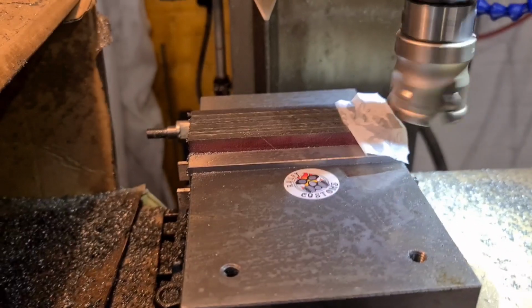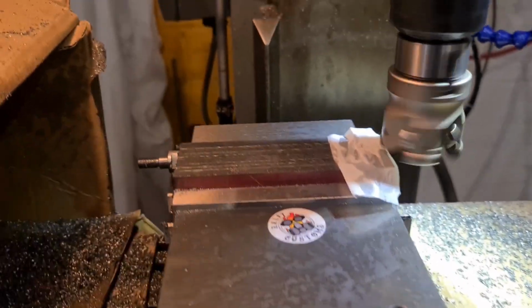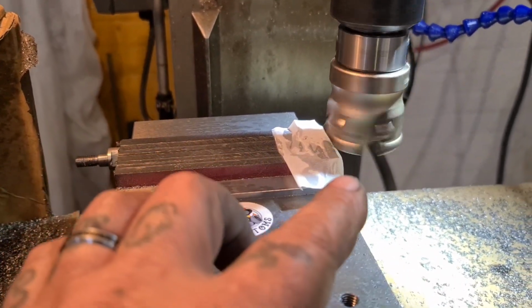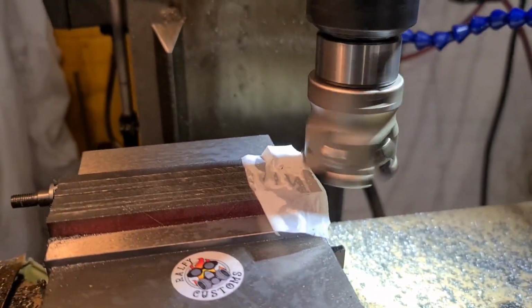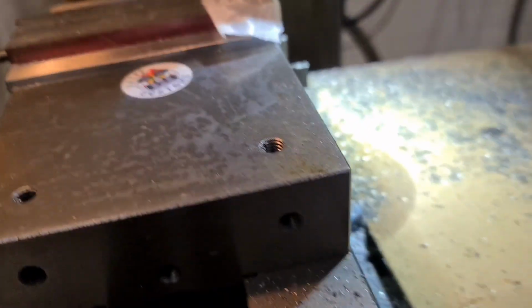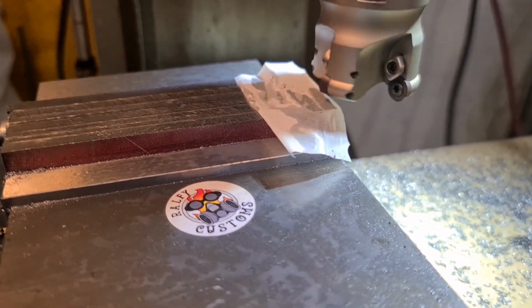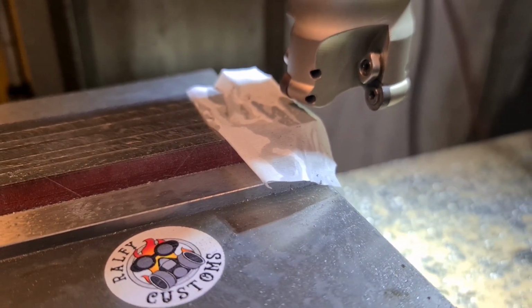So what I've decided, now I've machined this down, got rid of the mistakes, and got it about to the size I think I want, I'm actually going to run this indexable face mill shell cutter over the surfaces to face them all up. So it's like a modern day fly cutter, isn't it? The finish it gives is exemplary.